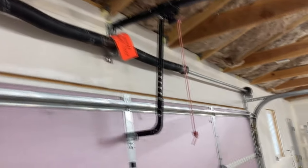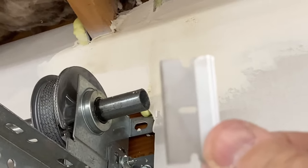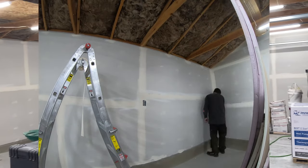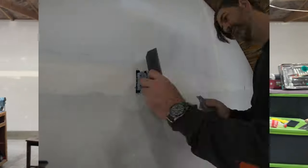That area is going to be one more coat and then sand it as good as it'll get, then I'll paint over it and we'll call it good. But for these corners here I can definitely do the best I can. There's a spot that needs to be floated out with the thinner mud, and there's some butt joints around here that have to be floated out with the really thin mud. So I'll be working on that today. Good day today - we went for a drive this morning, got our bonfire burrito, had a good cup of coffee. I might have another cup. All right, let's get to work.